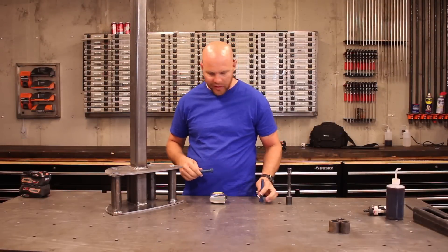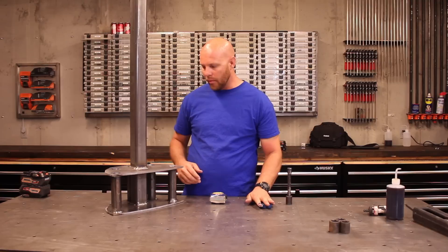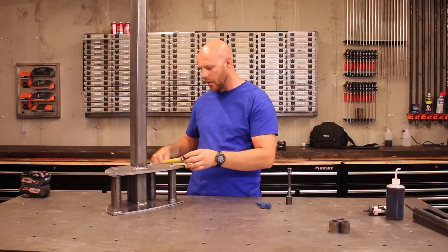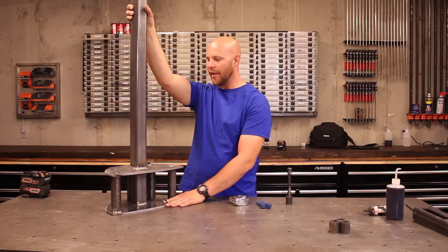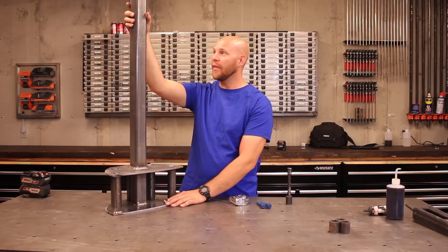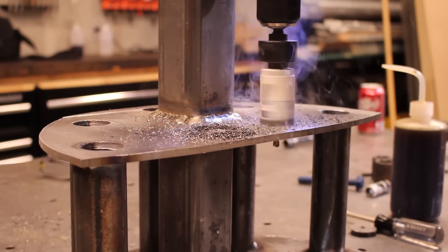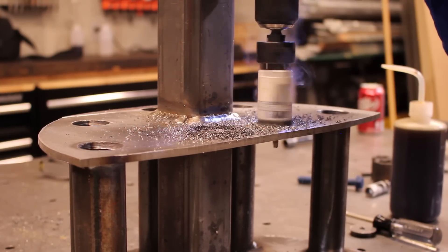So as is, I'm going to be able to bolt this down with five concrete anchors, which I think is going to be a ton of strength. But what I'm worried about is the distance between the holes in one direction is about 12 and a half inches, while going the other direction it's only less than six inches. So there's a lot of strength to prevent it from moving one direction, and relatively less to prevent it from tipping the other way — and the way it's going to be set up, I think it's going to be more vulnerable to being pulled that way. Just to make sure I don't ever regret not securing the post well enough, I'm going to add two more concrete screws for the heck of it. There's no kill like overkill, but once this thing is bolted down and covered up, there will be no way to secure it any better. So it's now or never.